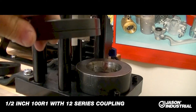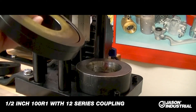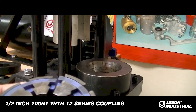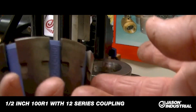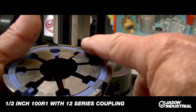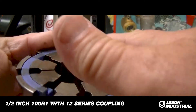We will be putting that down like that — the spacer goes down, and this is what the RAM actually contacts during the crimp cycle. Now I need to get the dies. For this particular hose we needed the size 8 blue dies. All the dies are color coded, and this is the example of the blue ones, the 8 size. I'm not going to lubricate these dies just for sake of time since they've been lubed already, but you want to lube this surface and also lube the top surface, just like you would with the Jason JCD165T420 dies, because the pusher actually runs on this surface and there could be friction along the angular surface.